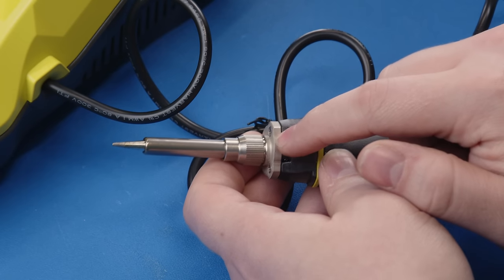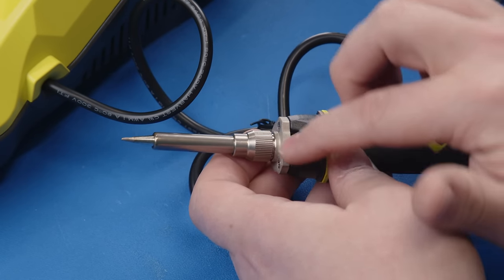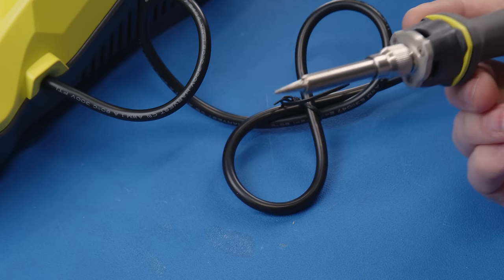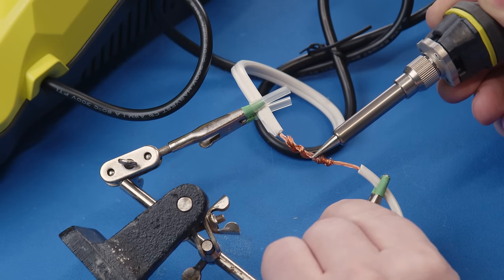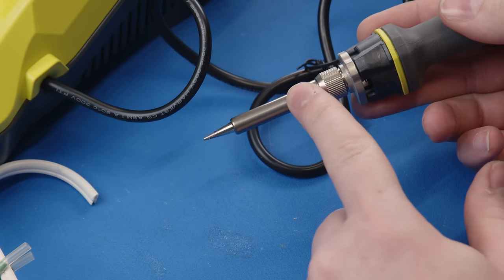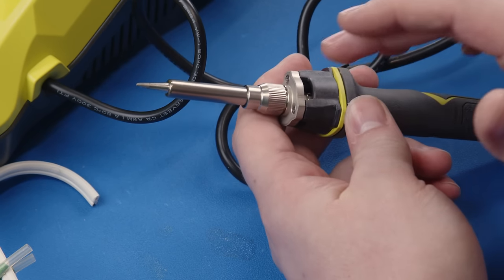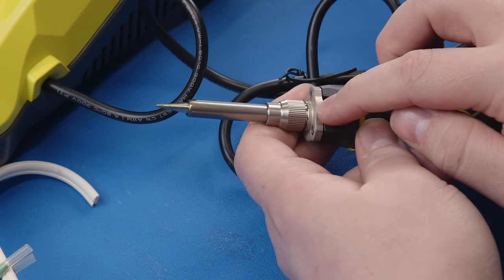On one of those cheap hang tag Weller irons, and a lot of irons really, this will just be a piece of flat stamped sheet metal with three holes in it. Now, it is taking the lever load from whatever you're pushing on up here, because remember that when you're soldering, like on a PCB, you're pushing the iron down into the workpiece, right? And the force from that is being transferred up through the tip, through the shaft, onto the spider here. So it is going to be taking a pretty decent load. If you're using it heavily, you're going to be leaning on this thing pretty hard. That's fair, but I've still never seen it built that heavily.